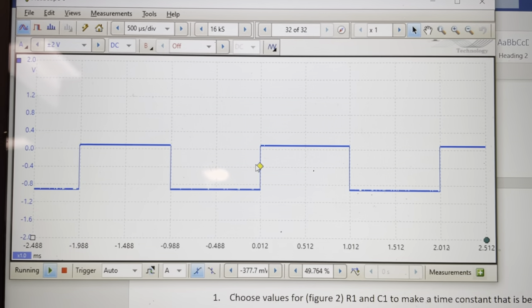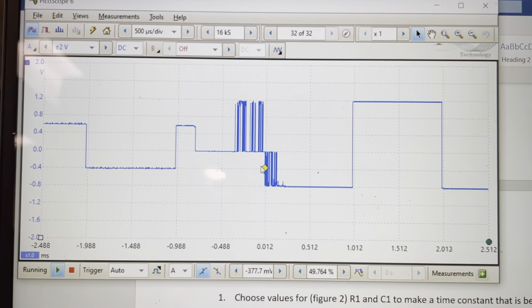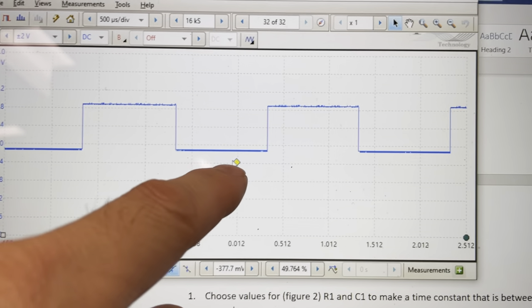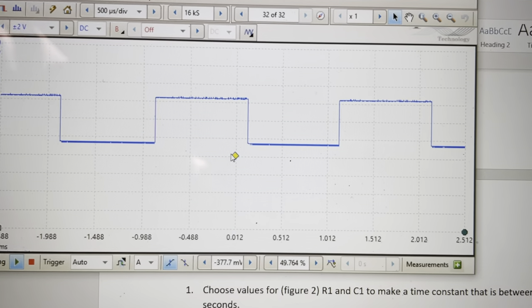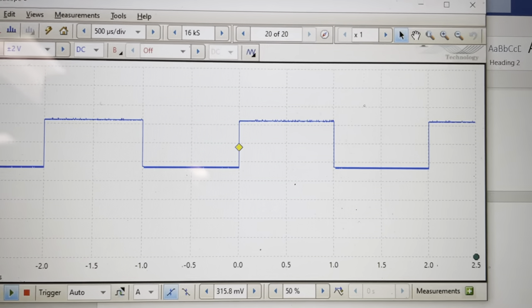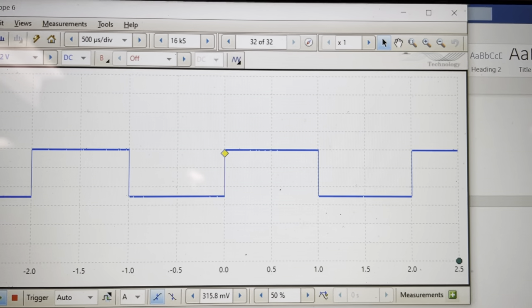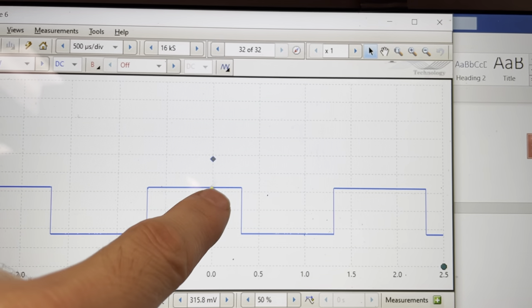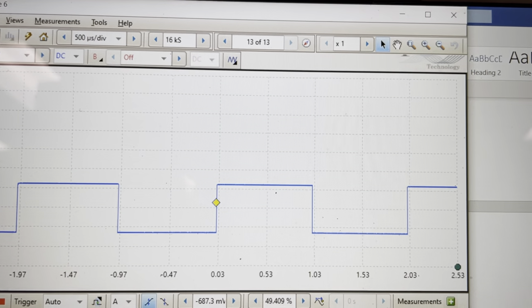I could use the offset to drive the waveform out of synchronization. And you can see I'm no longer synchronized because my waveform isn't crossing the diamond. I could either move it up and see if that works — now I'm synchronized again. Same thing if my waveform goes low: I'm desynchronized, and I could move my diamond down to resynchronize.